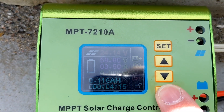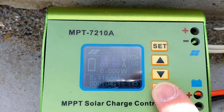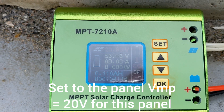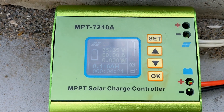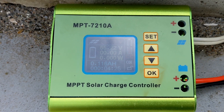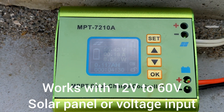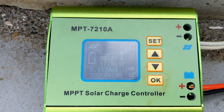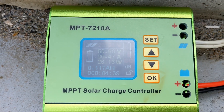I'll turn it off and show the ramp-up. This is a 20-watt maximum power point panel, and I have this green one set for a 20-watt panel — and that is apparently important. You want to set the target for this green MPPT to what the panel's maximum power point is, because it's not very good at finding that on its own. Now it's been several seconds and you can see the watts are starting to crank up.